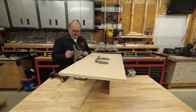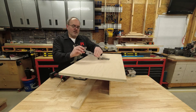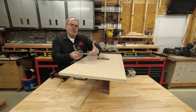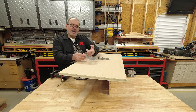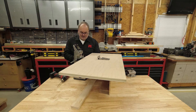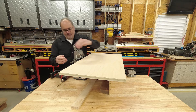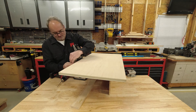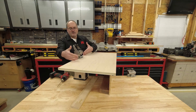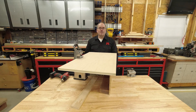I'm going to put in the work stop bar in the machine and then take the work stop. The work stops typically go in this fashion when you're butting wood up to it, but we're going to flip it around. There's a tab — an alignment tab — that is in the same plane as the fence. It's going to give us a wider base plate. Now we've got a much wider surface to help keep our stop in alignment with the actual pocket cutter.